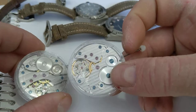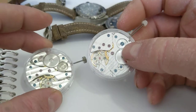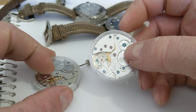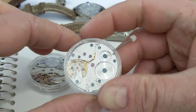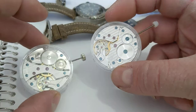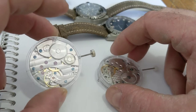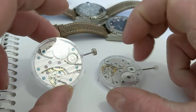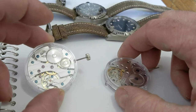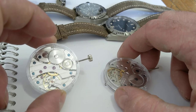It has that finishing effect on the Chinese ones, but from what I've seen, they seem to be stamped - very, very prominent. You can run your fingernail across them and it goes zip, because the Swiss ones are much, much finer. These might be stamped in rather than done with abrasive bits. They did a decent job, but its purpose is to go into fake Panerai. This is a bridge pattern Panerai developed because they got criticism for putting a base Unitas in - they said 'oh no, it's different,' but it's still Unitas, just different bridges.